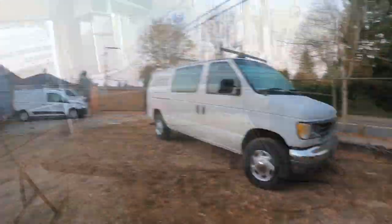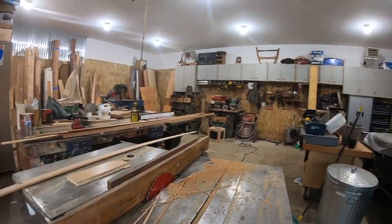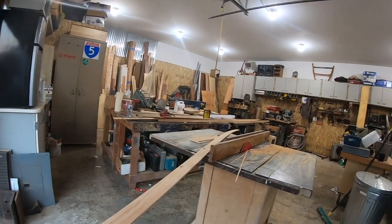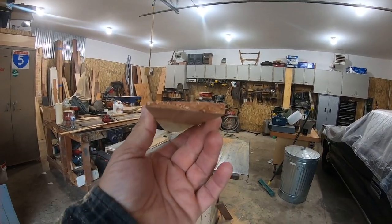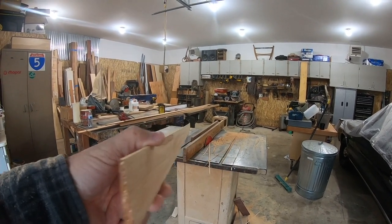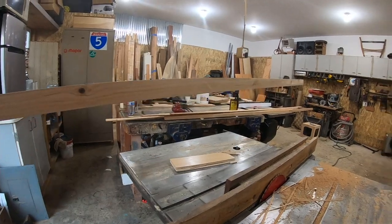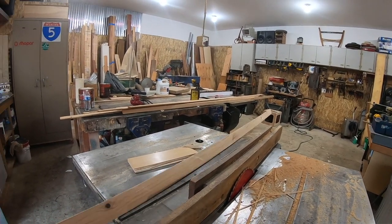We are in the shop here to do the little horizontal pieces to finish off the cedar siding. We're going to do a trim piece that's about two inches wide, which keeps the five-inch exposure on what's on the house. It's basically a little shingle wedge that goes up along that top edge. I went and bought the nicest piece of cedar I could find at Home Depot, milled it down, and I'm just going to leave the saw marks since it looks a little rough anyway.